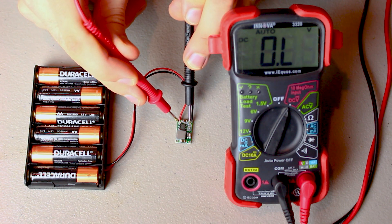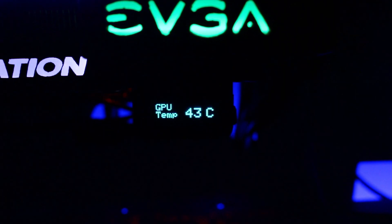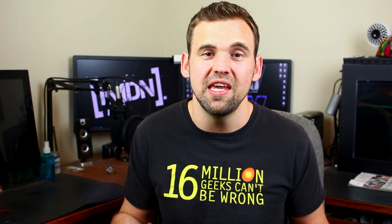Instead, I have another solution: a DC-DC step-down converter, also called a buck converter. They're called buck converters because they buck the voltage — like a bucking bronco. Buck converters become especially useful when you have a much larger voltage drop, say from a 20-volt power source down to 5 volts. You can simply use the trim pot on the buck converter to bring the voltage down, then use a multimeter to confirm the output. I actually used one of these buck converters inside my GTX 1060 graphics card OLED display mod, where I took the 12-volt rail from the PCIe connector and converted it to 7 volts for the VIN on my Arduino Nano.